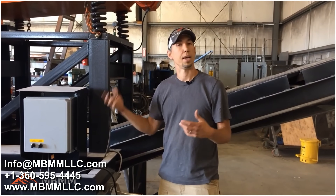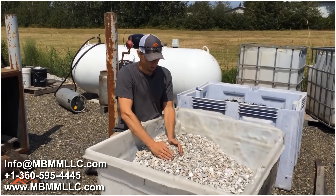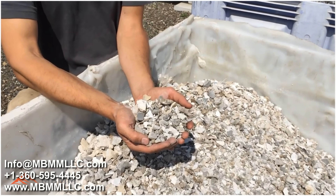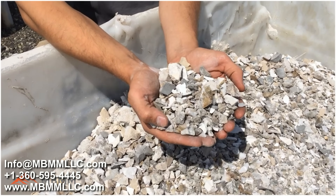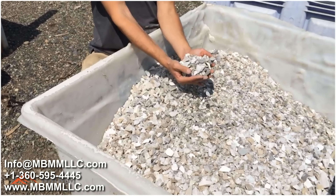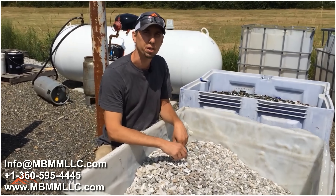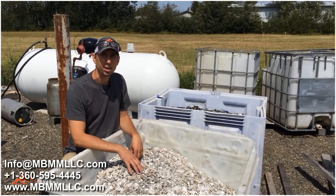With the diesel engine and the ability to run off single-phase power, you can run this unit at any gravel pit or operation anywhere in the world — you do not need three-phase power. Here are the results from crushing our sample through the jaw crusher module. This is a combination of granite countertops and quartz pieces, plus some large quartz boulders mixed in. The crush is really nice — it's almost all under one inch with quite a bit of fines. We have the jaw crusher set as fine as it'll go on this machine for the customer spec, and he's really happy with the product.